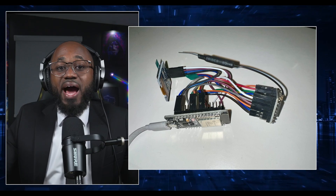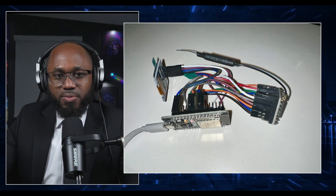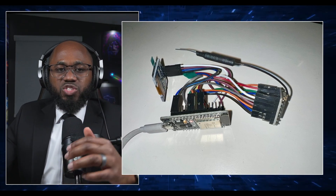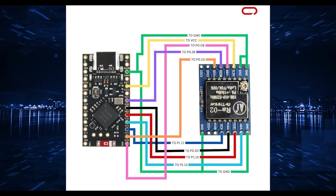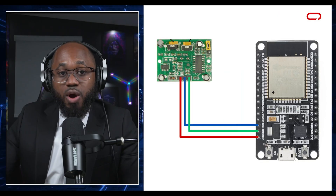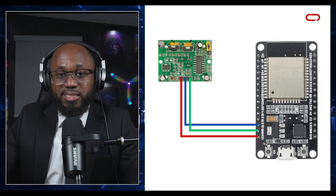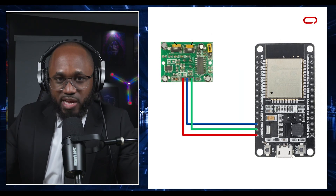Here's the third build: an ESP32 Plus LoRa DIY node — the Hackaday Reddit build. Basically, you have a typical off-grid ESP32 Plus LoRa DIY node build inspired by the Reddit community and Hackaday. To start, gather the hardware: two ESP32 LoRa boards — the ESP32-S3 Power Feather or the ESP32 LoRa version 3 — with the SX1262 or SX127X chip.